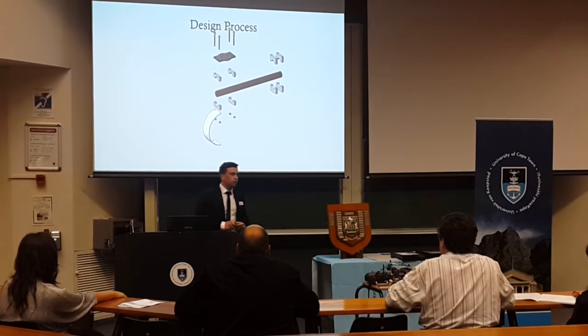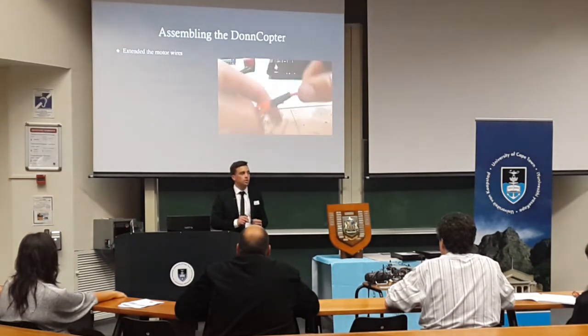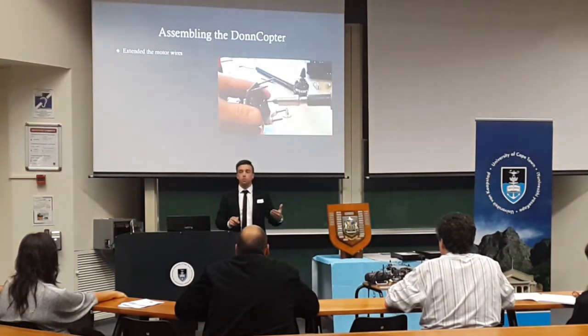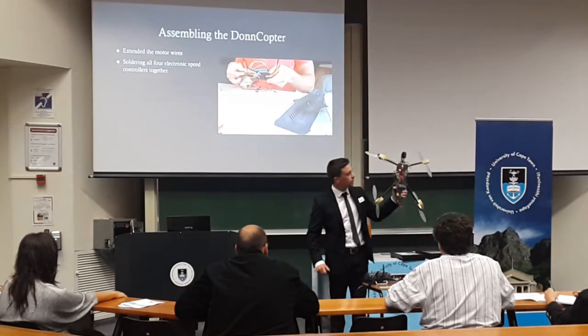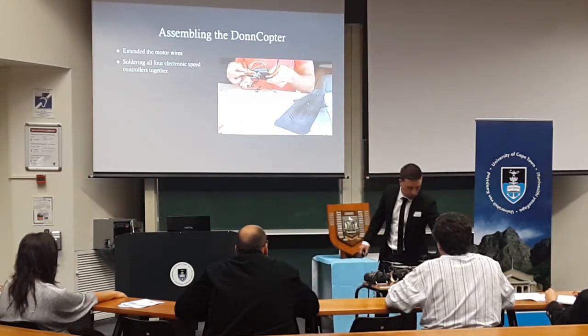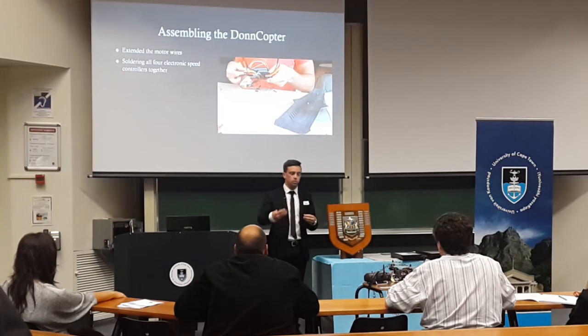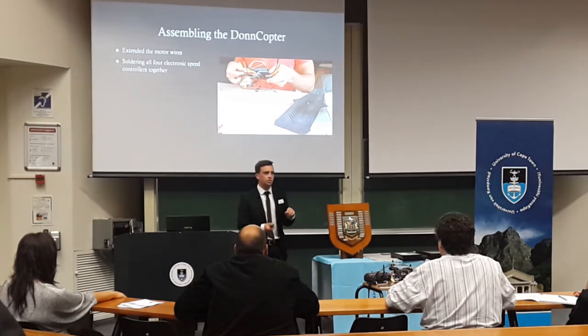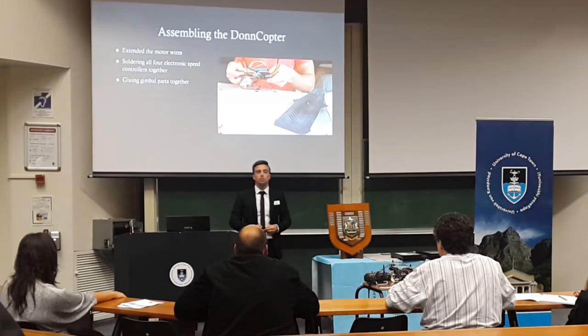In terms of assembly, there were a few modifications that had to be made to certain electronics before I could fully assemble and fly the aircraft. The first was that the motor leads, as standard, were too short, so I had to extend those so they could fit through the length of the arms. The next was that all four electronic speed controllers, fitted to the bottom of the aircraft and connected to each motor, had to be soldered together so that I had one point of contact between the flight circuitry and the battery — which you can swap out as it becomes flat — instead of four separate points. Once I got the gimbal parts from the workshop, I screwed them all together to make a rigid assembly, attached the motors, and then mounted it with vibration-reducing rubber on the frame.